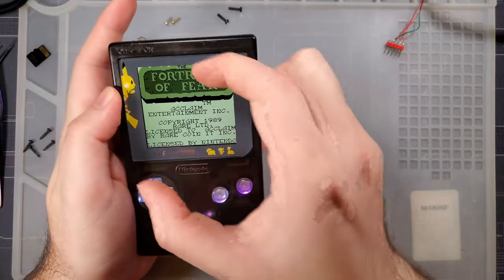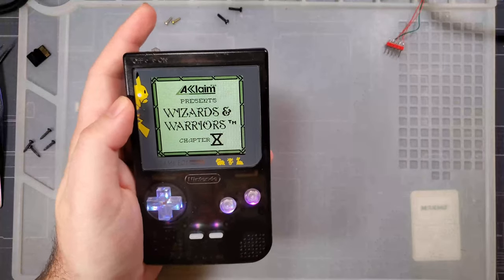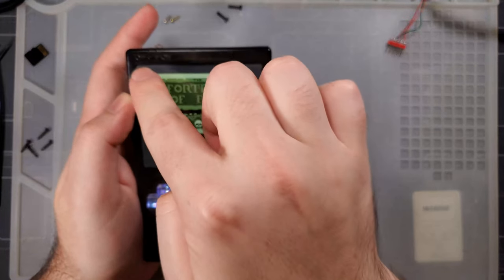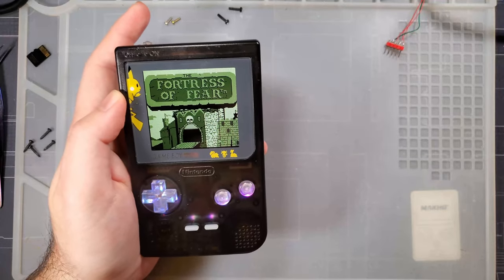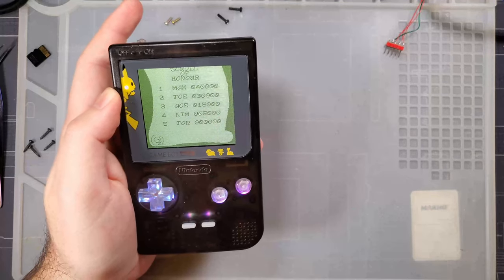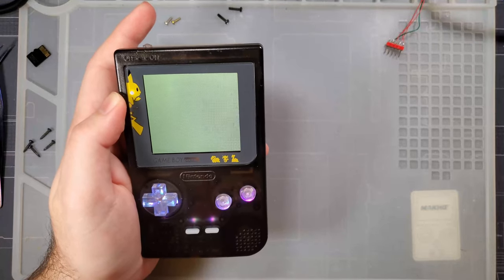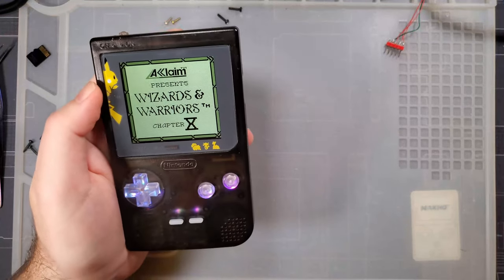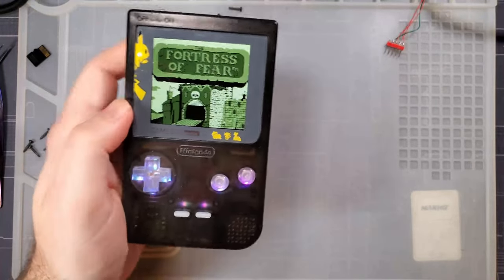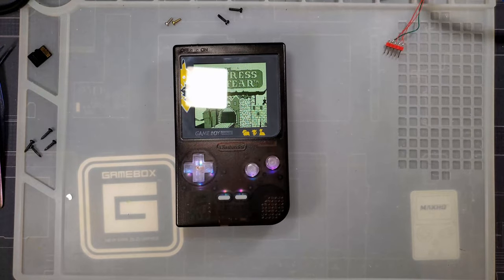The only problem is the microcontroller also dictates where the image is on the LCD. So if that's messed up, you're going to be locked to — I don't remember if it's the top left or bottom right corner — which doesn't work in this shell very well. Either way, not too bad. I'm really impressed with it, super cool stuff. I'll link to all the stuff that I use down in the description, including the programmer. Highly recommend wiring up header pins so that you can quick-disconnect and rewire stuff if you need to swap out programmers, as I did like six times.